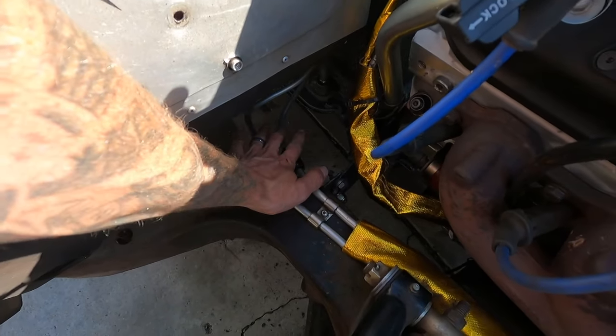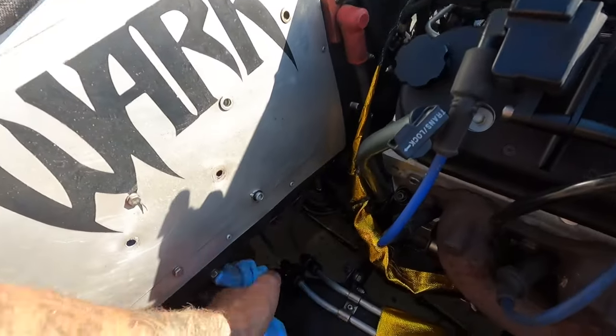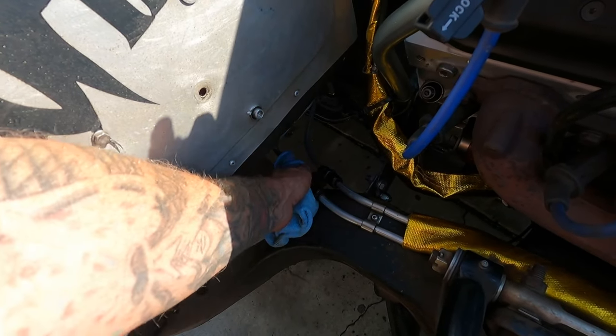We've got some sort of flow issue or an air pocket. I did bring some AN fitting wrenches - maybe we'll crack a line and see if we can bleed it with the thing running. We gotta make sure it's pumping that fluid out and circulating it, because otherwise you're not going to cool it very well. I bet money as soon as it goes through the cooler, life's gonna be good. That's why you test. I do not have any discharge coming out of here - I cracked these with it running, there was a little bit coming out but nothing. It's a hydraulic system, you'd figure there'd be some pressure coming out.